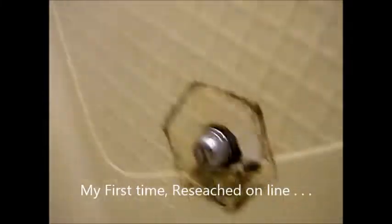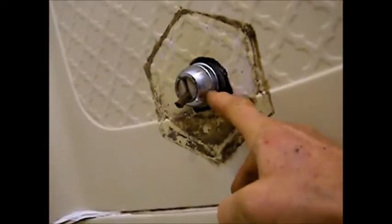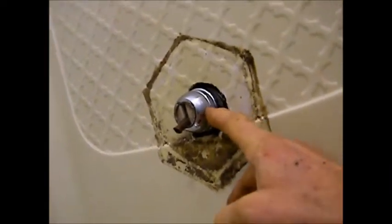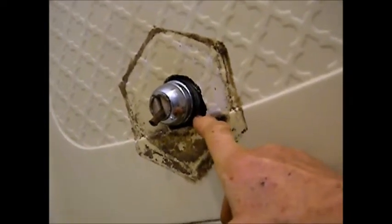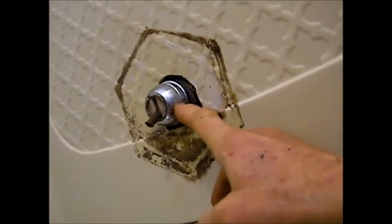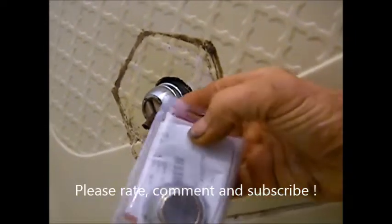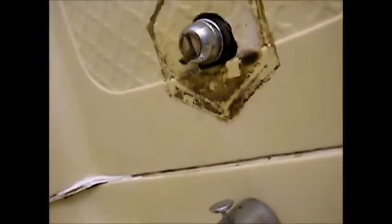This is gonna be one of the first generations of these Delta faucets. I got the cover nut because these are notorious - if you have to cut them off, you can't tweak too hard otherwise you'll pull the whole mechanism out of the fixture in the back. I need to heat this up and spray some WD-40 in there. The kit was like nine bucks at Ace - it's got a couple washers, a couple of springs, and an adjustment tool for the tension on the valve.